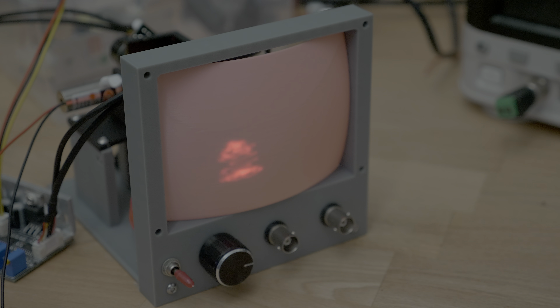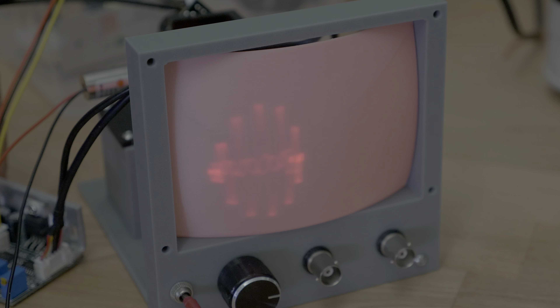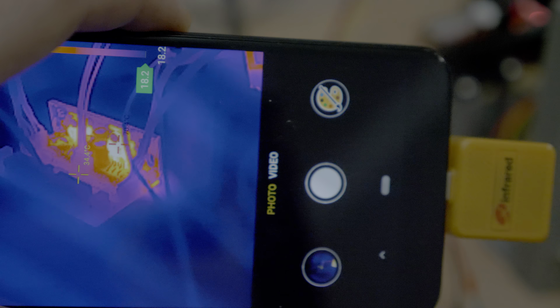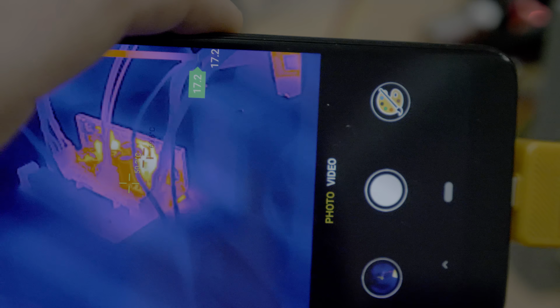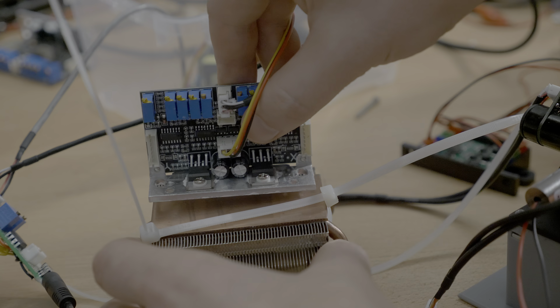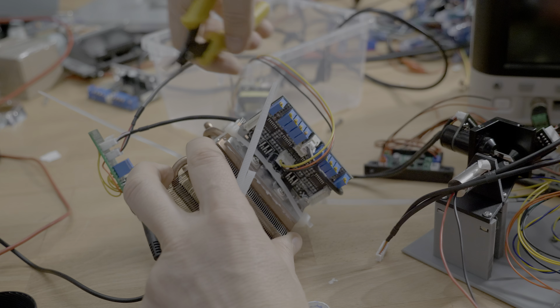After all this hassle we finally were at the point from a month ago. Driving the galvo at a high amplification to cover a greater area was heating the controller seriously — it's hot to the touch, these are glowing, 69 degrees. I like passive cooling, but with this heatsink all dreams to confine it in an old mini TV case were lost.